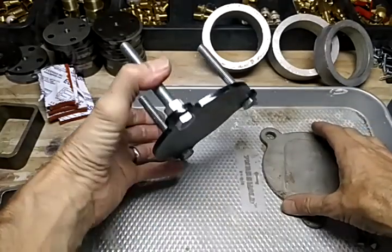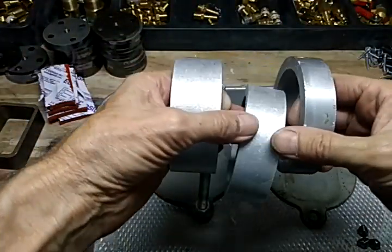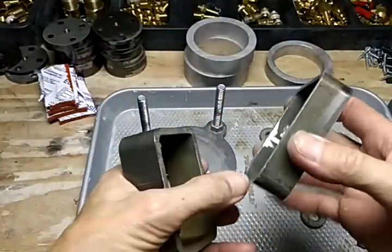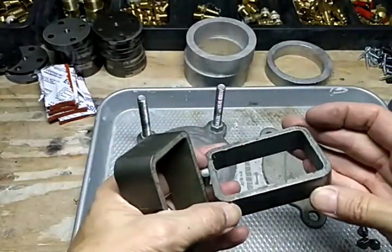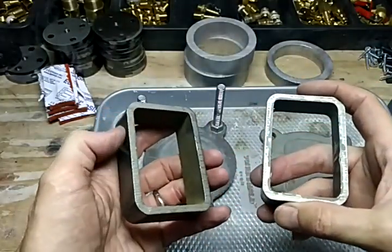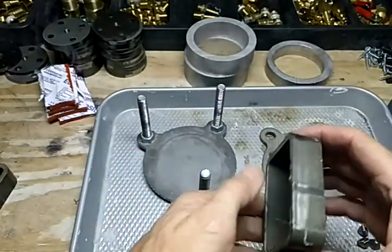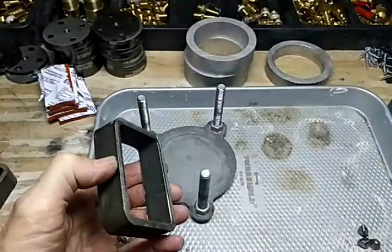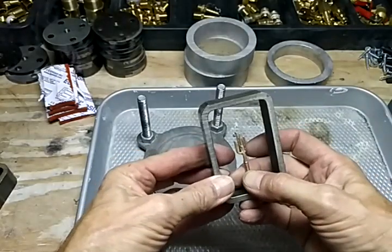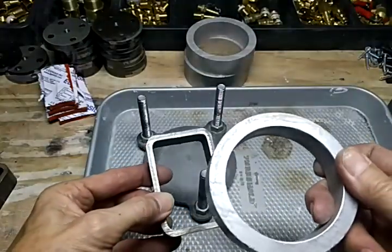When I created this setup I started out with round mold frames — I got three different sizes. Then at the metal supply place I saw these rectangular frames and decided to get a bunch made. What's great about these is they take very little mold rubber. I got two thicknesses: three-quarter inch and one inch. We're going to use the three-quarter inch because this saguaro takes almost no mold rubber and it'll work perfectly, saving a lot of money compared to using a bigger mold frame.